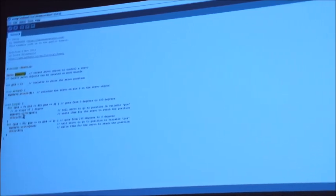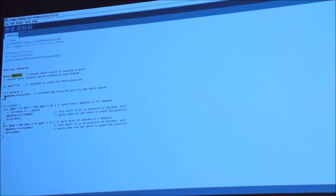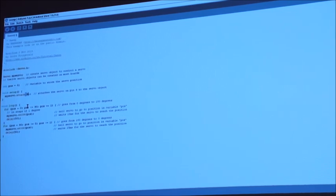And then what you can actually do is start to look at the code and see duplication. So my servo, your servo, Lawrence's servo, they each need attaching to different pins. So I'll show you that when we start to connect the head up. So now I've got a second servo. If I connect the second servo, I'll just quickly show you how that works. Let's just connect it on. This is where you start to run out of power connections on the board.